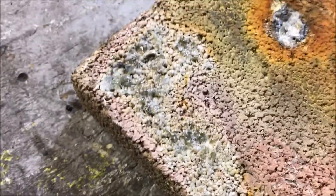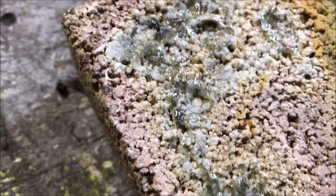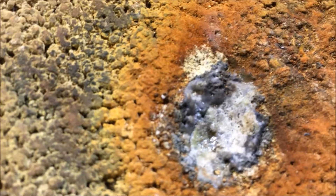Fellas, what is up! I just found some footage that I forgot to put in my last video. Essentially, I was normalizing my electrolyzer, or my dry cell, getting the gaskets to shrink up, and had to run the torch for about half an hour. So I decided to sit here and melt some fire brick and burn some other stuff while I was at it. I just wanted to show you guys just how powerful that oxy-hydrogen flame can be — it literally boils fire brick.